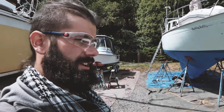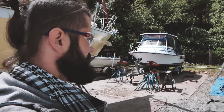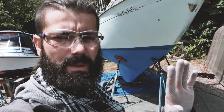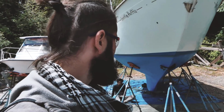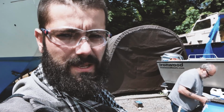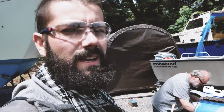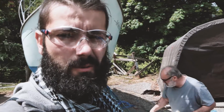Well, after a morning of soldering fumes, we're now gonna go huff a few more fiberglass fumes. Vern is doing a bit more polyester work today. We got the epoxy work on the midsection all done, so that's ready to be painted. I just did a little bit of fairing coat right on the front, and so that should be ready to paint. But the last one we got to go do is Vern is patching a through hole that used to be there for his water speed indicator. Yeah. So we're patching that guy up, and I'll walk you through that one.